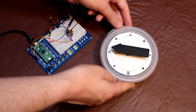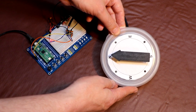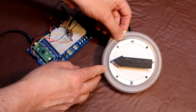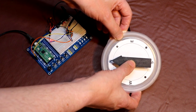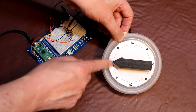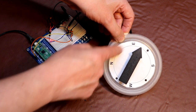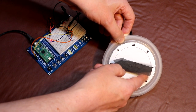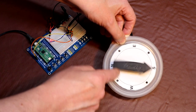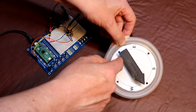Now there is actually a relatively straightforward solution to this problem of losing count that can be employed for some systems. So what we have to do is to add a reference point, which works in the same way as pressing this switch here, which allows the count to be 0. So you can imagine we could add a reference to the north here, and even if it started up at east position, as soon as the wind blew round to the north, this system could zero itself, and then it would be okay again, until which point it lost power. And that could certainly be a solution.